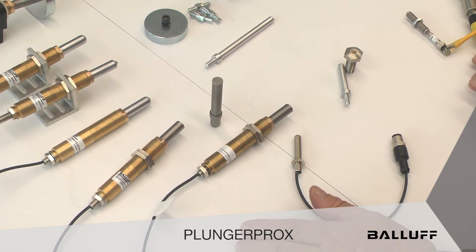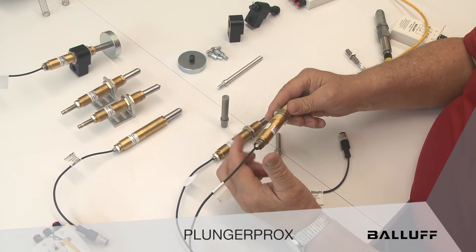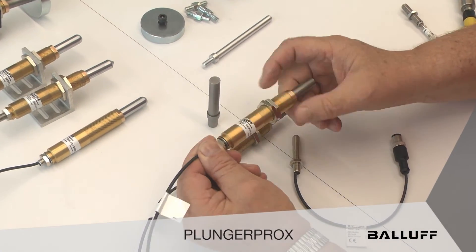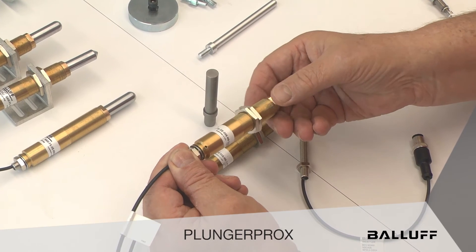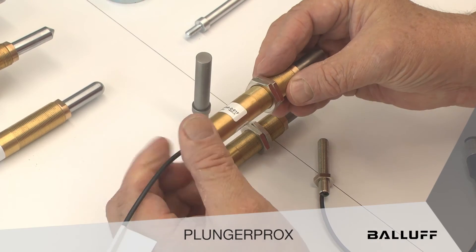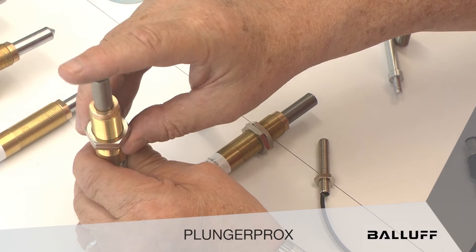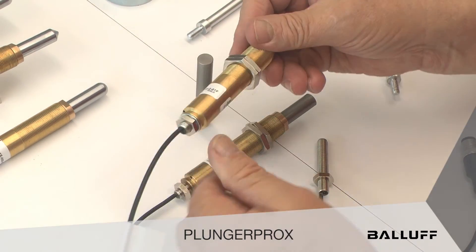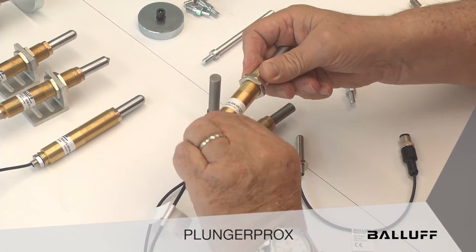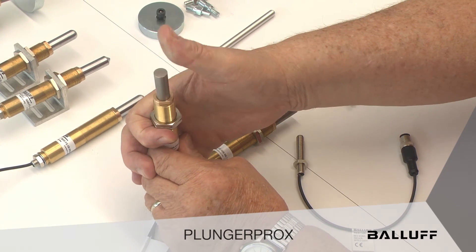Let's talk about actuation point. We have some of these pre-wired. The way we make this work, we'll back the sensor out — you'll hear the tester come on here in a minute. If you want a very light trigger, just rotate it out about a millimeter or so and we actuate it very, very lightly. If you need less sensitivity, thread the sensor out a little bit more — it will activate further down into the travel, but you still get over-travel, so you're never damaging a sensor.